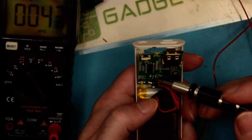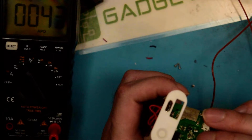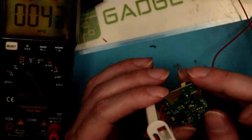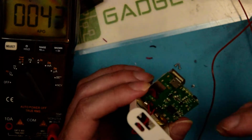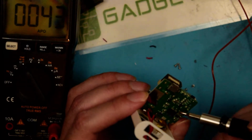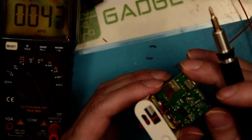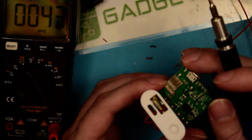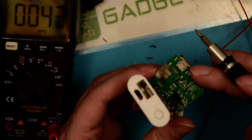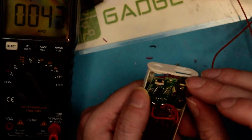We've got a transistor here that's switching power to the heaters on the front and back. We've got two different ones there. Wow, there's actually a lot going on here. We've got a bunch of different control circuitry. These look like, yeah, these are dual MOSFET packages here, so they've actually got a very robust charge protection for the lithium cell there, which is exceedingly surprising considering these were super crazy cheap.